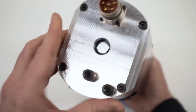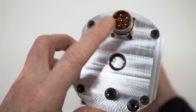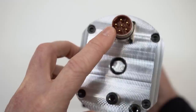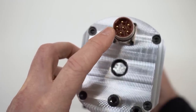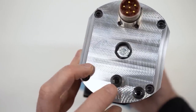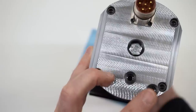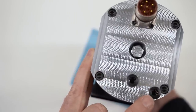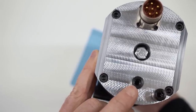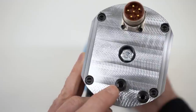On the back of this spindle are all of the connectors. There's an electrical connector with the three phases of the motor, plus a safety ground, plus two wires for a thermal cutout — so if the motor overheats, we have a feedback signal to trip the VFD and shut it down. We also have two quarter-inch OD push-to-connect fittings for air: one on the outside edge for purge air for the case, and one closer to the center to activate the draw bar — a pneumatic draw bar that releases the tool, lets go of the pull stud, and allows tool changes.